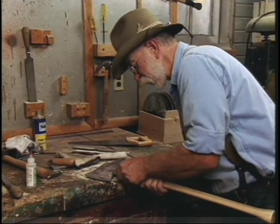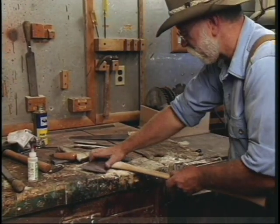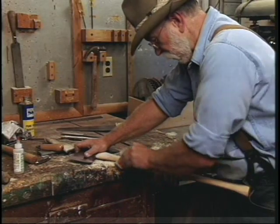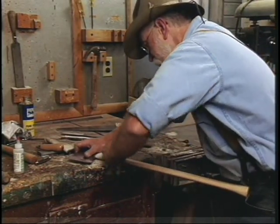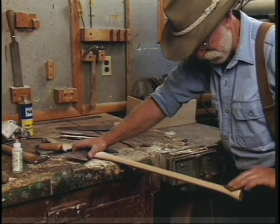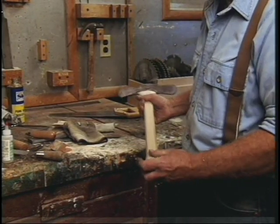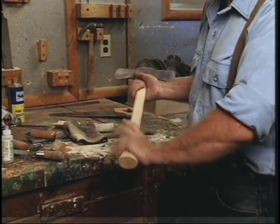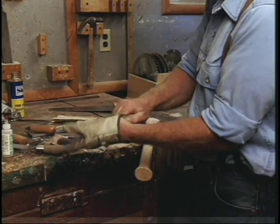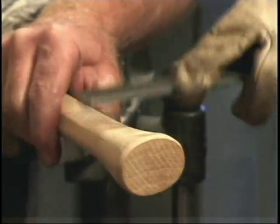Properly fixed, properly hung. Never put the steel wedges in cross-grain, which you sometimes see in axes — why would you want to split the grain after you've just hung an axe? I kind of like to run a little sandpaper over it and clean it up where we had the rasp. Then run your sandpaper over the waxed surface to take some of the wax finish off — get it good and clean and smooth. Do the whole handle like that. After I've sanded it down, for purchase so you can get a good grip on the butt, I like to rough it up with the rasp or the four-in-hand — just take it and run it across the grain like that.